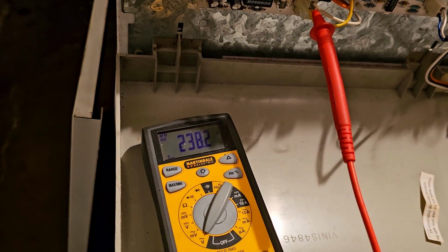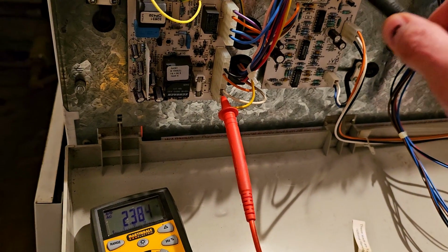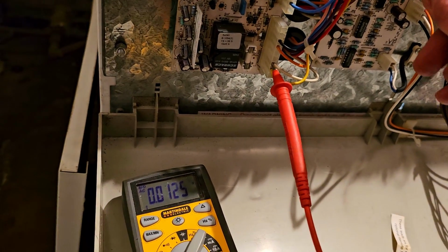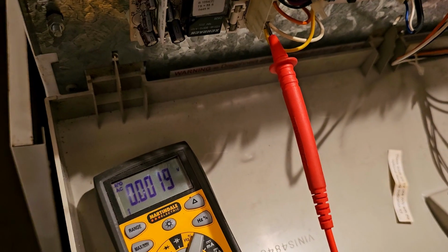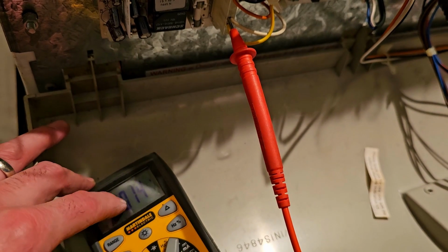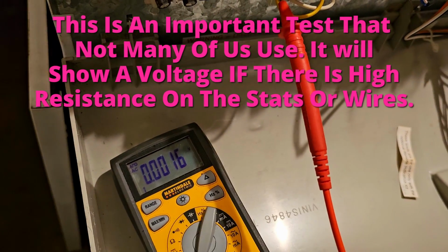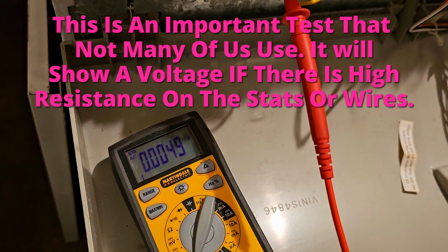Okay, how can we... Right, if there's a voltage drop across these wires, like I say, I think it's the pink feeding it. So this should now go 0, and it has, because they're both 240. So that's showing 0. If there is a voltage drop across that, then it should show up here as a voltage, and that will be the drop. Sparking, no, it just bounces around.